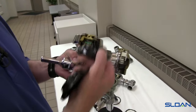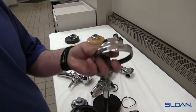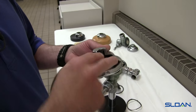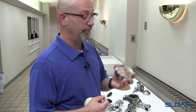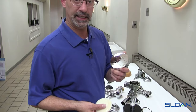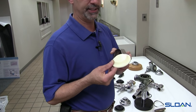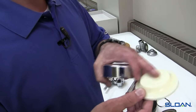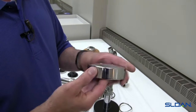The A11 old-style inner cover will not fit in the current valve for obvious reasons — its specific design is for the old-style bell-shaped cover where it properly maintains structural integrity and seal. On the rare occasions that your installation may have a continental cover — it's got just a smooth, low-profile dome — most times it will be stamped 'continental.' This uses its own inner cover, known as the A71 Special, which is actually molded on the inner cover. It has no nipple on top, but it's braced against the top, the shoulders, and the outside edge.